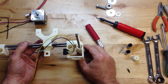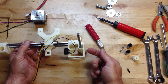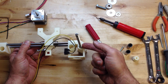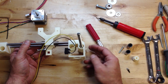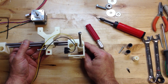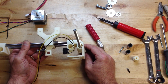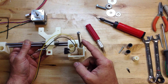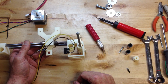I designed this to be much like the Prusa in that if you wanted to take any Z slop out at all, you can put a spring in here and then put a nut down on the spring so it gets rid of all this. But I ran it like that — first of all, it's harder to align your motors when you have the requirement of that being absolutely perpendicular. I find that if you leave this nut and spring out — I don't even pack them in the kit — this thing will wobble a little bit like this, but remember, that is not affecting your print. It's riding on the smooth rod, not the threaded rod. The threaded rod is just pushing it up or down. So if this moves around, who cares? It doesn't matter, it doesn't affect the print.